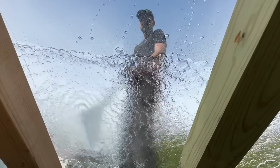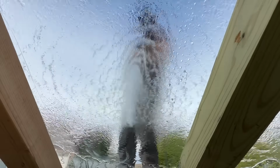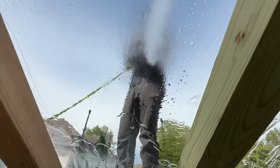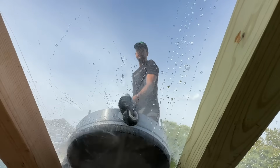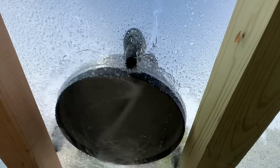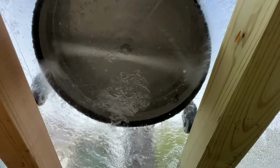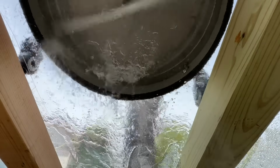Taking this perspective, you can quickly see this is the 40-degree tip. You're going to vary the speed that it's striking the surface and the distance it's striking the surface. That's why you get kind of a wave pattern finish and also inconsistently clean concrete. If you compare that to the surface cleaner, those tips are staying a constant distance away from the ground, and the speed's going to be consistent as well, resulting in a cleaner surface in less time.